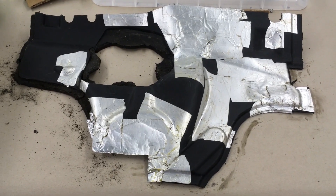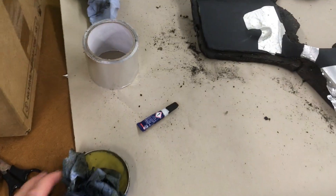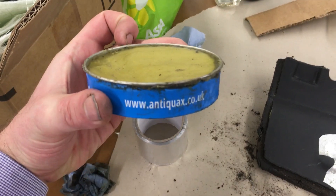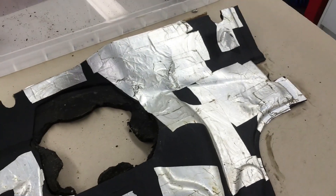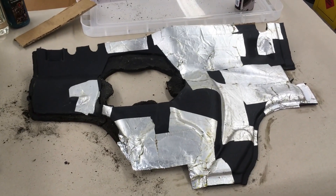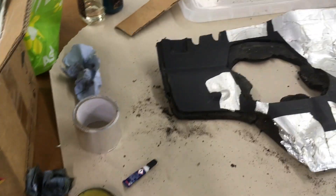Fingers crossed that works. Now I've got all the aluminium tape on. I'm using wax — just antique table wax — as a kind of mold release agent. I'm going to go over the top of that with some proper PVA mold release agent. I'll make it clear: I'm by no means an expert in fiberglass — I've just taken some advice off a friend.